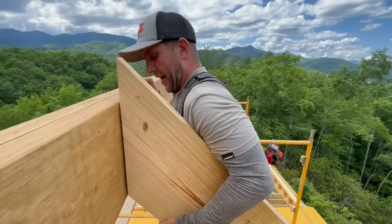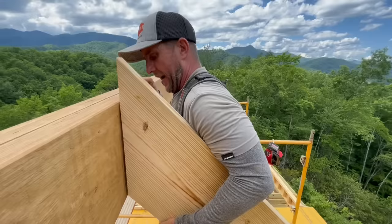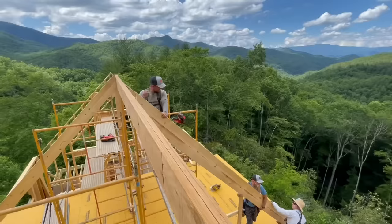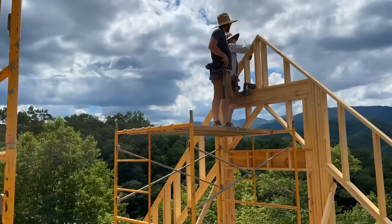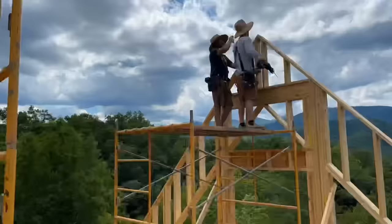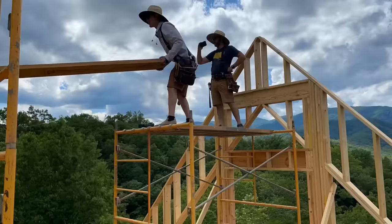Our rafters here are also yellow pine, two by 12s, 20 feet long, and they're heavy. We're aligning the heel of our rafter cut with the bottom of this beam, then letting the rafter stick up — and that allows for ventilation for our ridge vent. A note is that these are overkill as far as structure goes. Two by eights would have been plenty strong, but there has to be 11 and a half inches for the insulation to go in this roof. So you have to use two by 12s to use conventional insulation and then leave that air gap above the insulation.